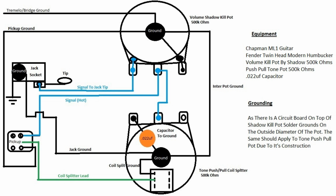Now then, this green wire, and that incidentally happens because both of these coils, the slug pole coil and the adjustable screw pole coil, are connected in series. In other words, they're connected one after the other in the middle. And that's how the circuit would normally work as a humbucker. Now, with this particular pickup, there is a green wire which is tapped off at the point where these two coils are joined. And it's this that does the magic of basically splitting the coil so that you get that single coil sound, that nice clean cutting sound that you get from a single coil pickup.